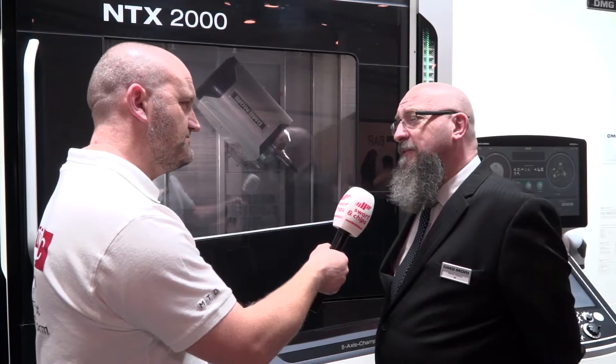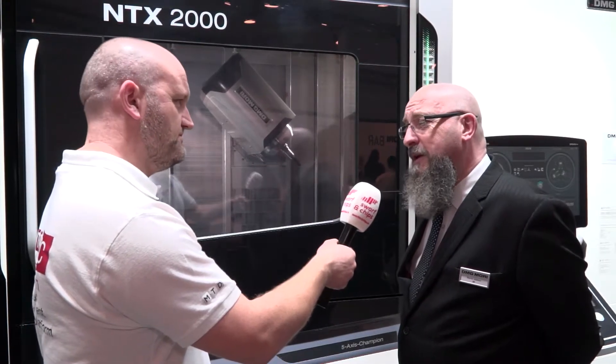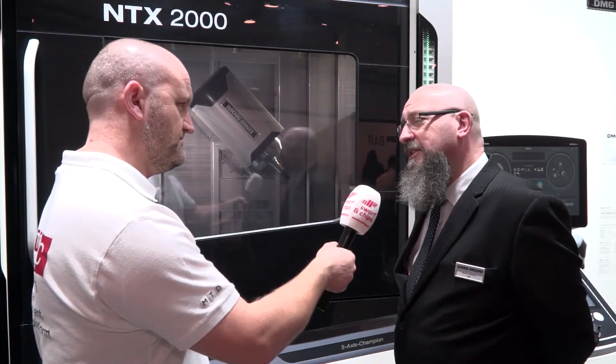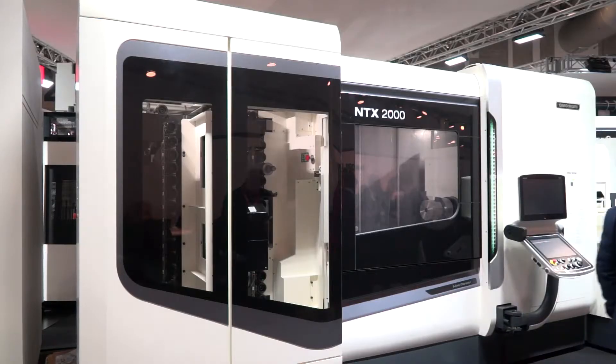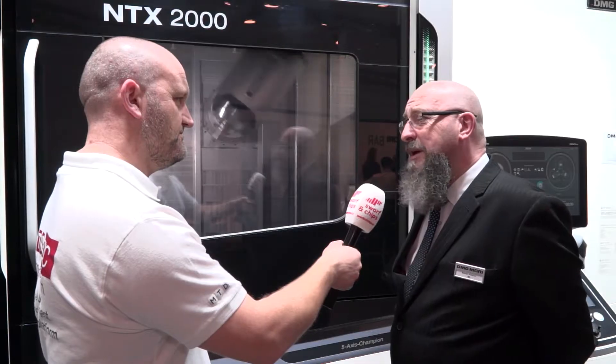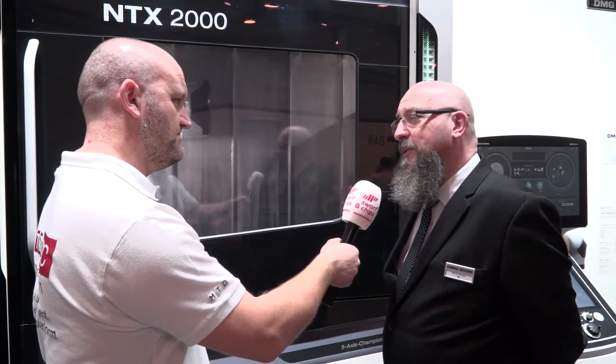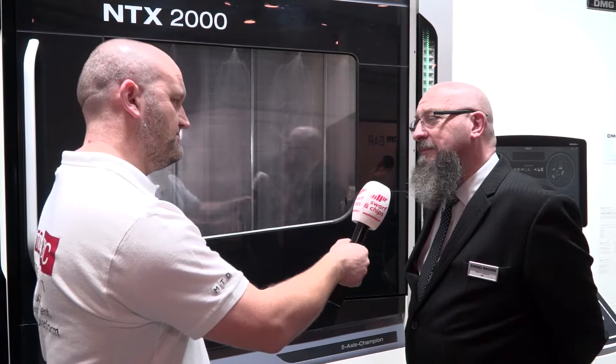You can utilise it for production of ports and profiles on the outside, simple programming methods utilising the CELOS control to generate bores and tapers on the outside of components, simply by interpolating the whole profile — whether it's a groove or a bore in that manner.